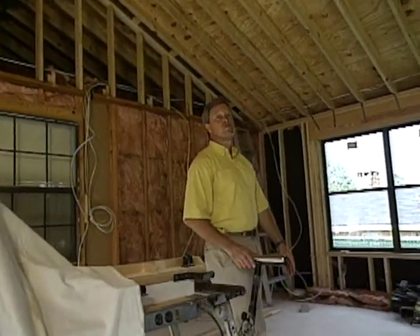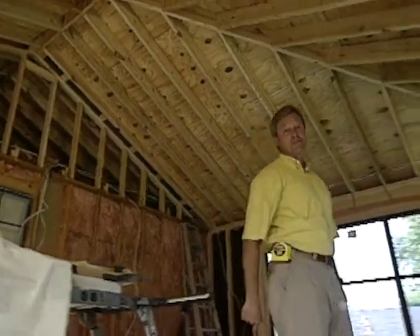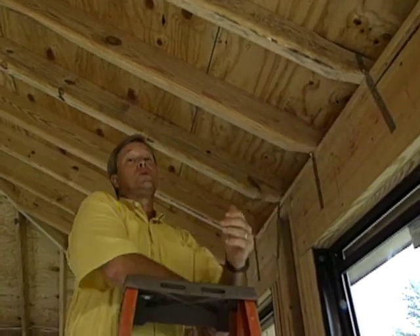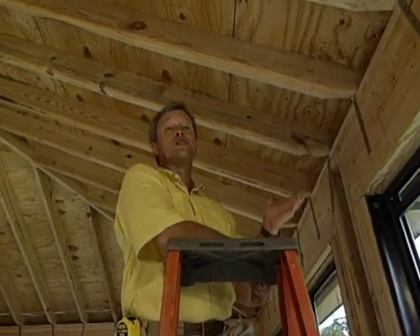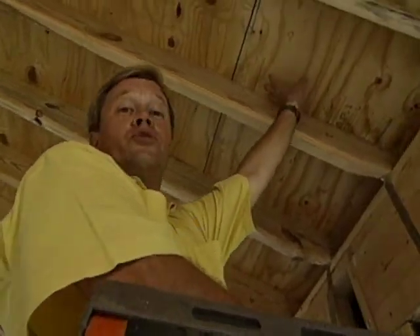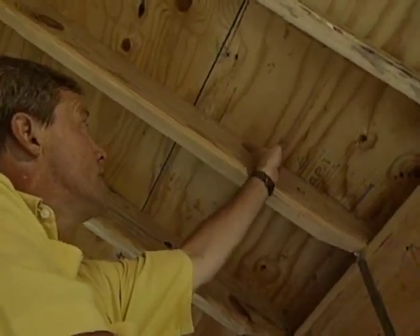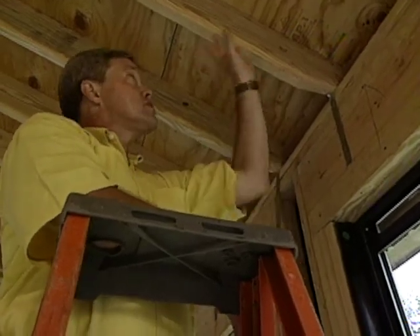The room is 16 feet by 24 feet, and what makes it truly impressive is the 13-foot ceiling achieved by taking advantage of the hip roof design. The roof construction starts with two-by-eight rafters on 16-inch centers — we could have used two-by-sixes on 24-inch centers to save money and time, but the two-by-eights were needed for several reasons: they support both the roof load and the half-inch drywall ceiling nailed to the bottom side. They also allow six inches of insulation, leaving a couple of inches for air to flow in from the soffit areas up to the attic, keeping everything cool and reducing moisture accumulation in the closed ceiling area.